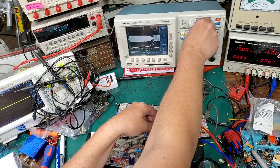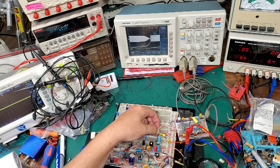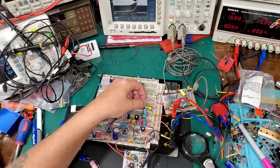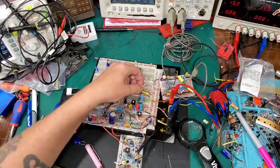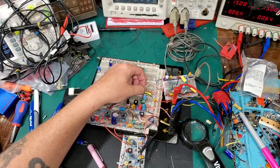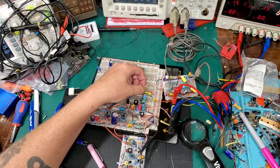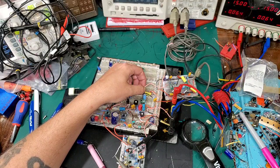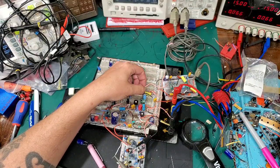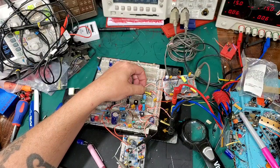All right. Anyways, that right there, those little squiggles, is the purpose of this whole shebang. Was it worth it? I don't know, person. Was it? Is it worth it? I don't know. Anyways, I'll probably get back to tearing stuff down. Or maybe not. I have a couple more things that I'm going to make. I just figured if somebody wanted to know why their AN262 wasn't working, maybe you need to switch around the positive and negative inputs of your op amp number 3. Okay? Okay then.